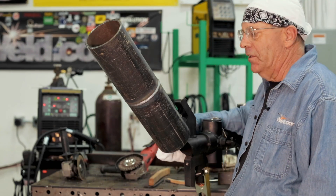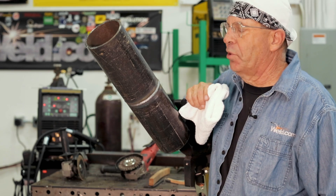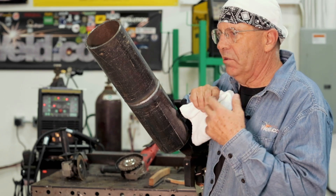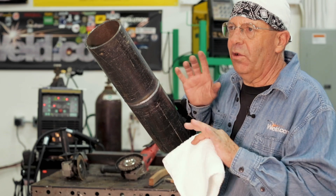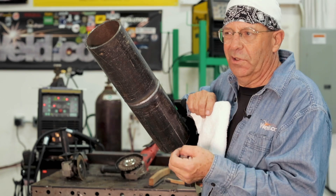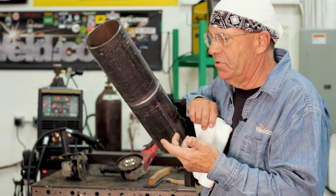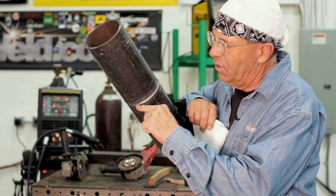I realize this is a short video, but I'm under a little bit of time constraints here. I wanted to do this because it's pretty common and I've been asked about it a fair amount. I started out tending a little bit tall — missed the wire feed speed a little bit. Not an excuse, but I haven't run a whole lot on that machine, but it's really impressive, responsive, stays with you, ran pretty smooth. Schedule 40 has a pretty narrow groove. It's real common in shop fabrication to do TIG roots, MIG fills and caps — weave level with the floor.